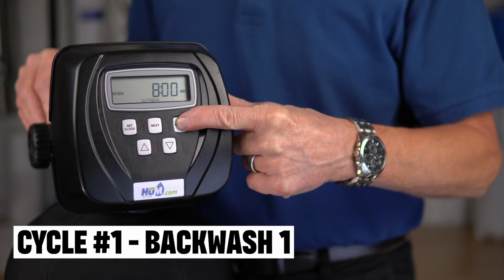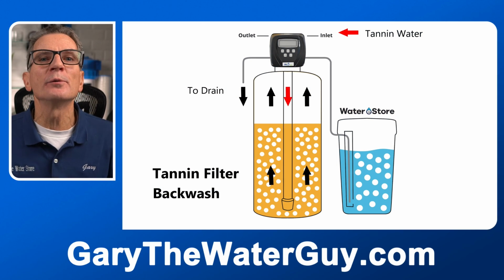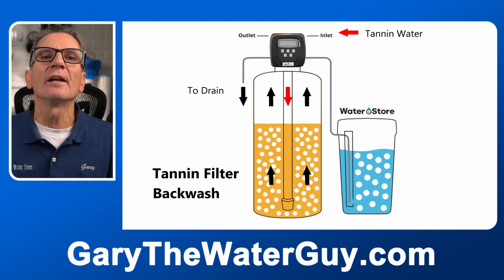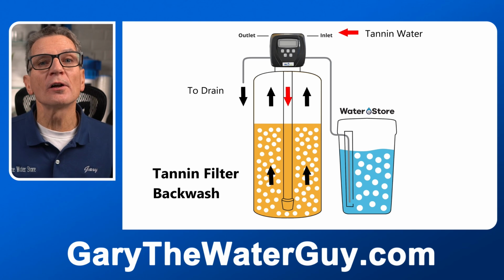The first is backwash. The valve reverses the flow through the media tank, so now the water coming into the media tank flows down through the riser tube and out through the basket and expands the media to fill the whole tank and flushes all of the debris out the drain. Meanwhile, in the brine tank, you have water and salt. The water absorbs the salt, making brine.